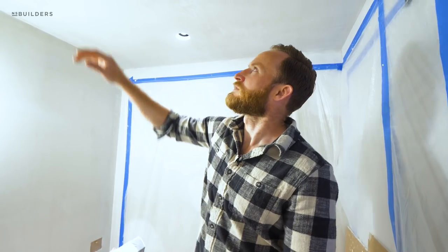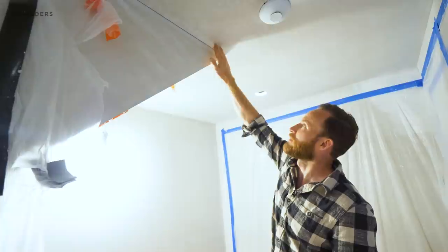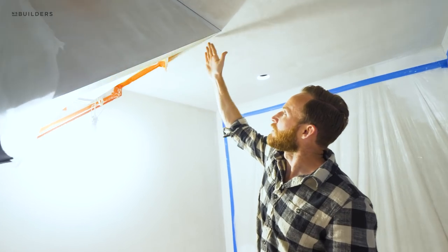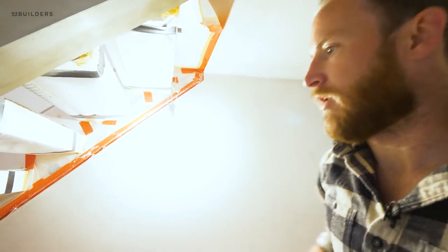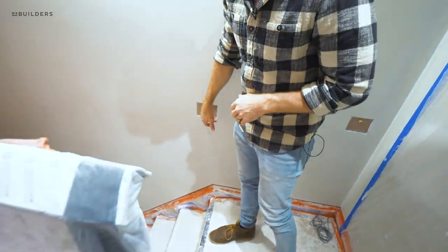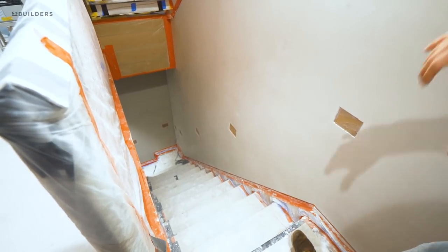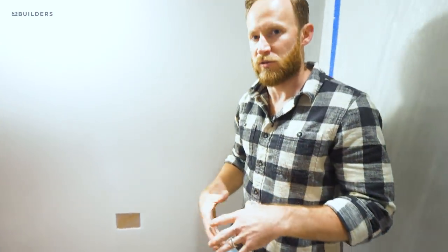We're celebrating that this staircase is its own sculptural piece. There's so much thought that went into making sure this cap came in, hit this line, stayed aligned with everything else, hit the bottom side of the tread, hit the shadow gap, and went all the way to the bottom. This is actually the last section where we're doing painted plaster — these squares are left out for the handrail brackets so they can straight-edge this wall flat, then cut out, install the brackets, and patch in small sections rather than trying to plaster around the handrail brackets.